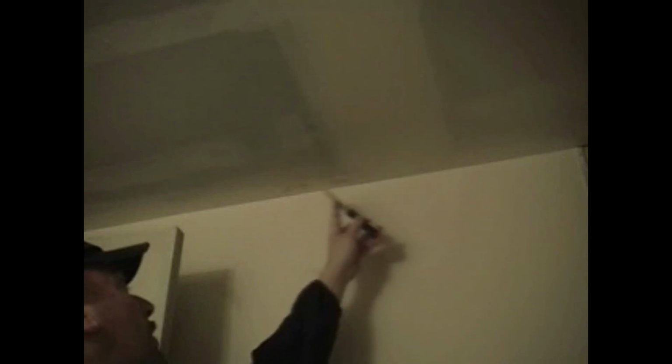Well, starting off on this coat, I'm going to coat my angles first. Last time we coated across the flats, across this angle, and you can see the tape right here. So we're going to cap that by coating across it, and then we run our flats. Hopefully this will be dry enough, the angle in a little ways, to be able to pull into it and to run our flats. But first off, we'll coat our angle out.